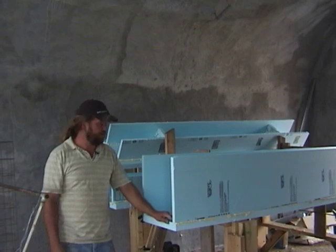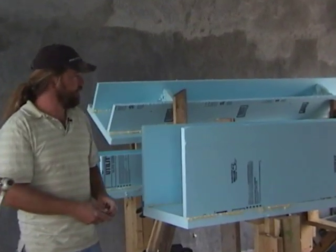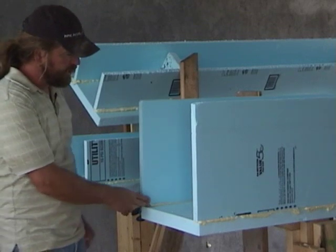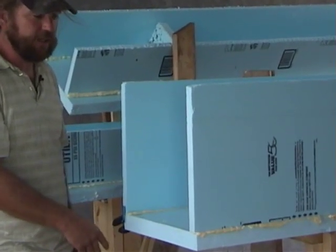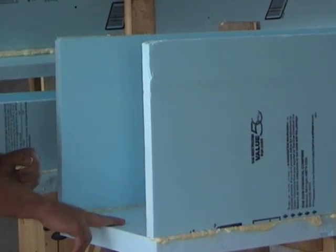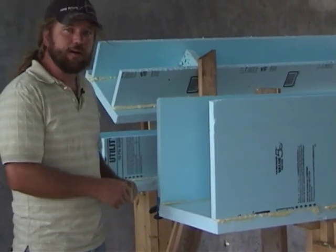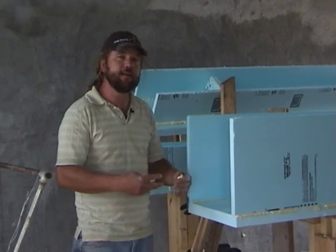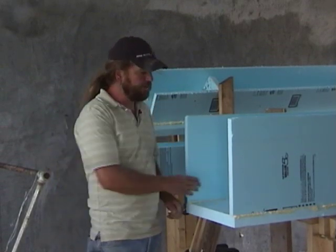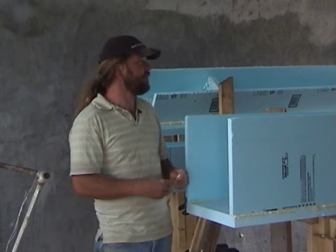This is an engineered design. It uses a box beam principle rather than using a solid beam of concrete with rebar in it to make a solid base for a home. What we do is we skin these insulated forms with the laminated ferro-cement, which means we embed layers of reinforcing. That reinforces this kind of concrete beam with active tensile reinforcing, whereas rebar inside a concrete beam is called passive reinforcing — it doesn't do any work until after the concrete beam is broken.